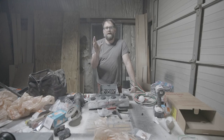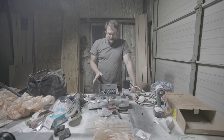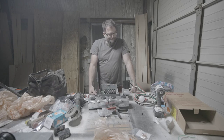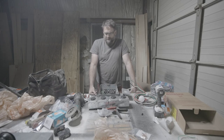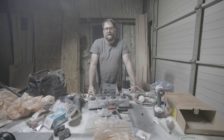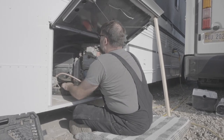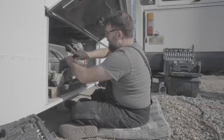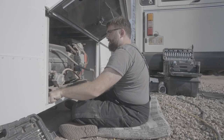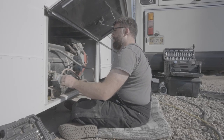I don't know if I have to have an automatic connect and disconnect or whatever that generator is doing. But wired in this way, we have four 30-amp circuits. Now we're going to go out and see the physical placement — which side to put the knockout on to connect this main power into this box. I'm disconnecting this old damaged wiring from the generator head, and we're going to inspect everything inside before we hook it up and hope for the best, because the last thing we need is a fire that burns your bus to the ground.